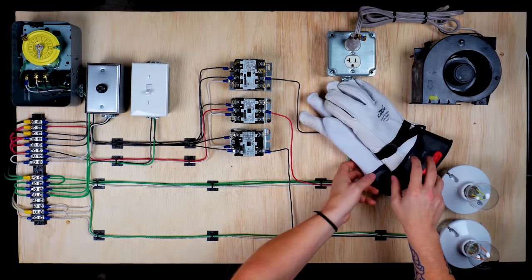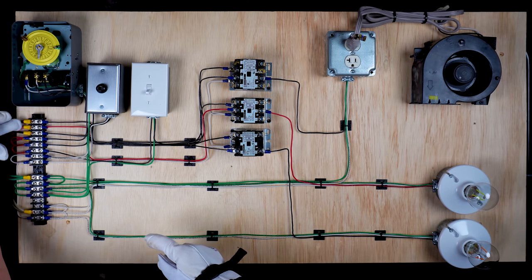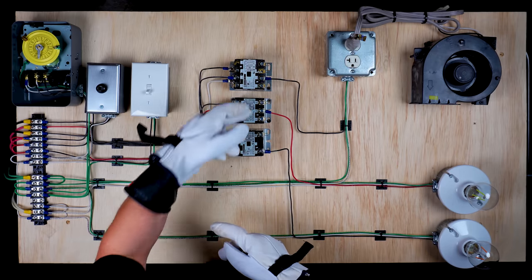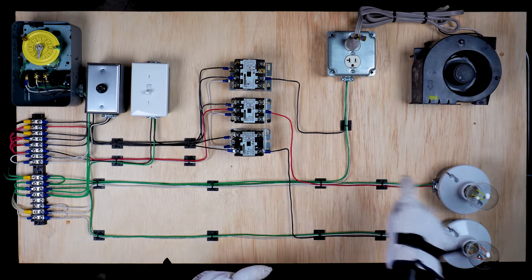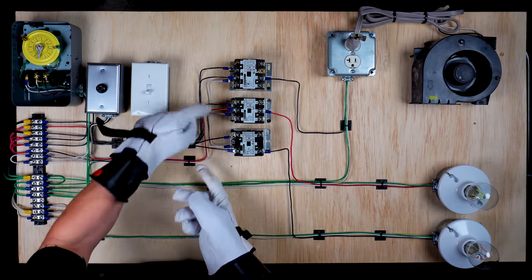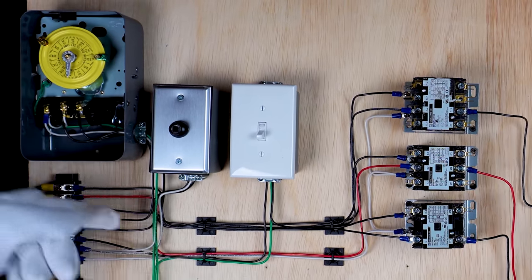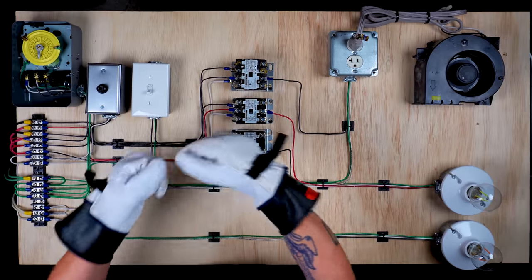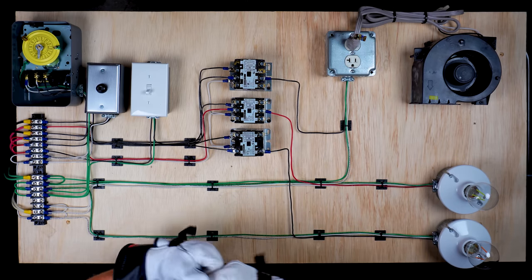Now let me show you how these automatic components work in an automatic circuit. I've got three different contactors, a manual switch, a photocell, and a time clock. I've run circuits — three home runs going into each contactor, and three conductors going out to a fan, and two lights. Each contactor has a coil circuit. The first coil is wired to the time clock — when the timer hits a set time, it sends power, energizes the contactor, closes it, and turns the fan on. The second coil goes to the photocell and will turn on a light. The third is just a manual switch.